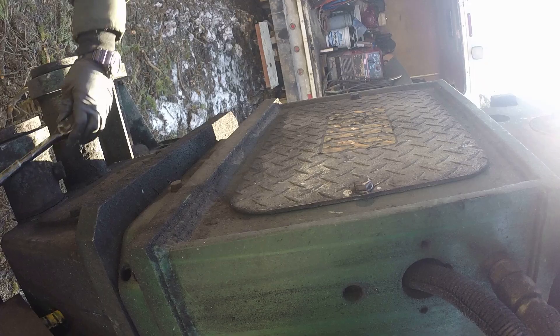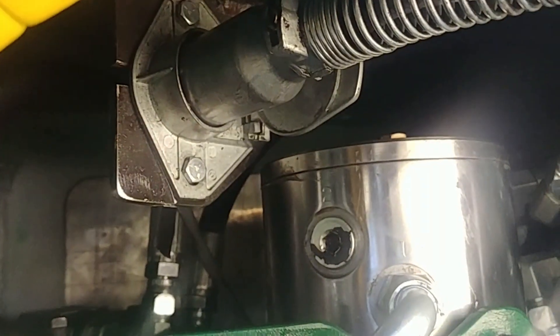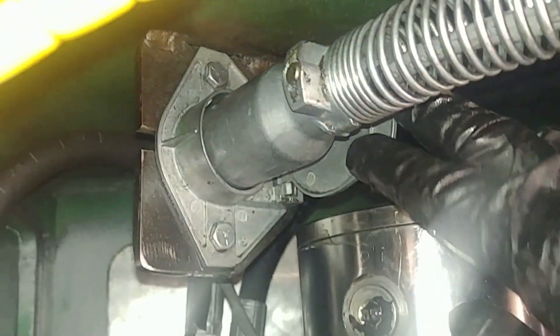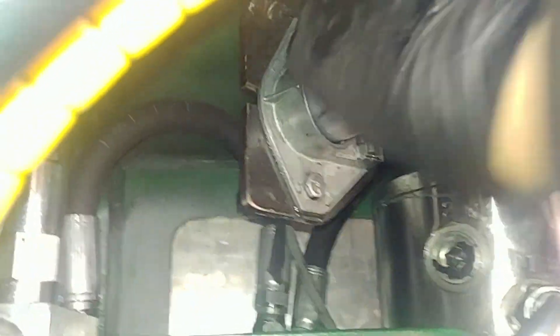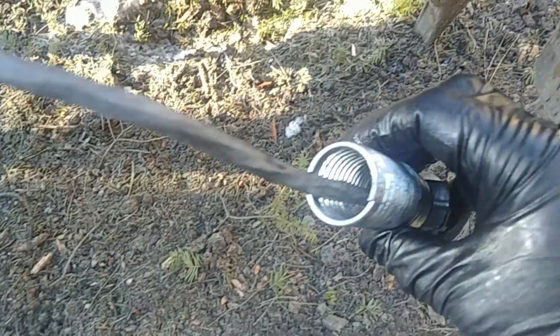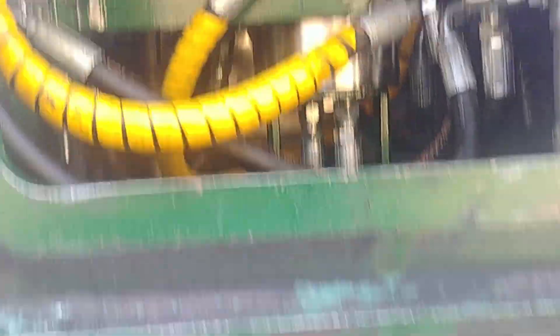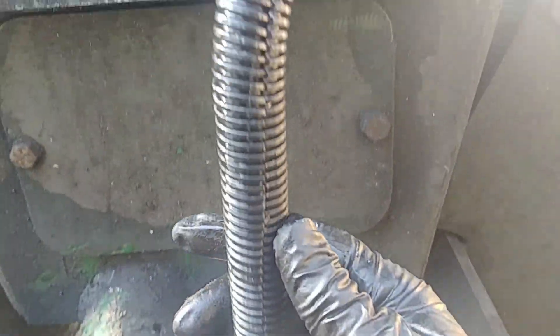Where's the harness or the grapple, and where is the issue most likely to occur? Starting from the connector — inside the grapple we see the connector for the harness. Unplug that and check for water intrusion, rust build-up, and loss of continuity. Then follow the harness and check the loom, going from the connector.